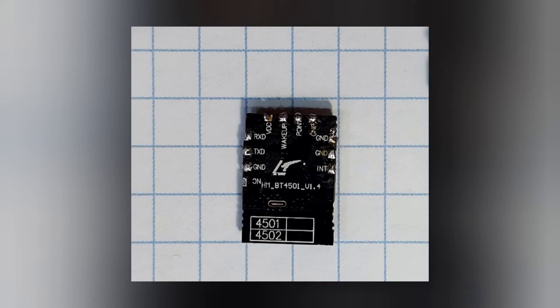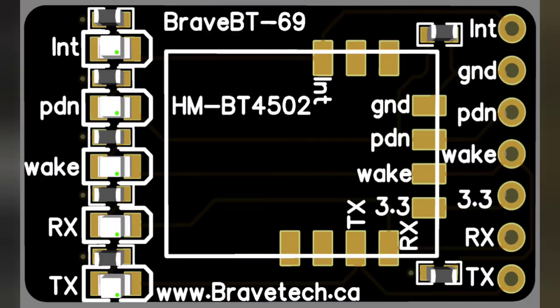If you don't already have the footprint on your circuit boards it's a little bit hard to solder, so I designed a breakout board just for myself, or if anyone needs one. They're available on my website — you just solder on the chip, the BT4502, and then you have all of your larger pin outputs for your typical breadboard. I also added some indicator LEDs, more just for troubleshooting, to let you know when all of the pins are active.